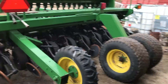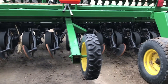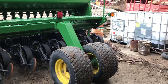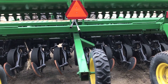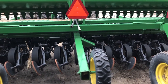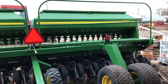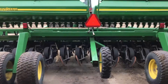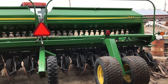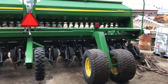I guess I just wanted to say how I got this drill. I'm going to start doing some maintenance on it. The only major thing I really have to do are these firming wheels here — the bearings are bad in probably 80–90% of them. These two are ones I already replaced last year, but I'll probably just go ahead and buy a full set of new wheels. As I'm doing everything I'm going to check it over.